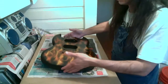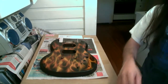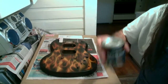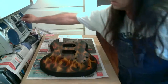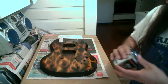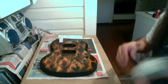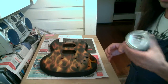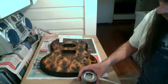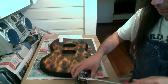Before I do that, I need to go ahead and clear coat the front. So I'm going to do that with this polyurethane. I was actually going to use a spray version — it does come in a spray — but my teacher told me he thought it would be best to put it on by hand with a roller or brush, because some of those sprays have solvents. We've got a couple different types of paint on here and we don't want it to lift any of the paint.